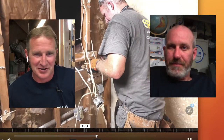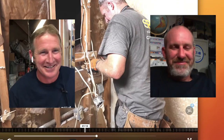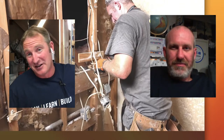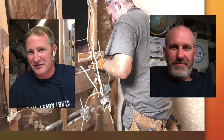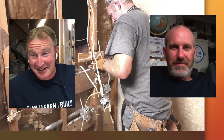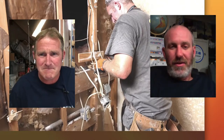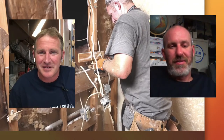A lot of times you come in, see a new GFI outlet and think things are updated, then you tear out a wall and end up with a major mess. The biggest thing I probably see the most of is having an outlet off the lighting circuit — because that was just where the power was. A lot of the homes here in Pittsburgh were built in the 1920s through 50s, and they really didn't have all the things we have these days.